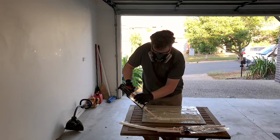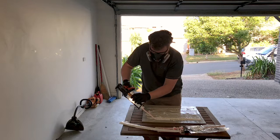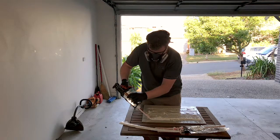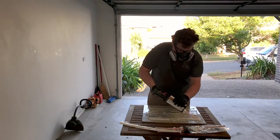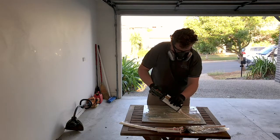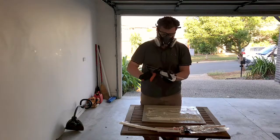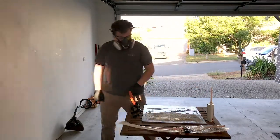So you can see the bowed effect from here, and that could be an issue if you're doing a miter and you had a reasonable size fillet on the back side of the miter, which you should, but if you've got it shrinking excessively, it could also pull the miter out of square. It's not something that I've had too many problems with, and I don't hear of anyone complaining about it, but it might be a handy thing for you to know one day.